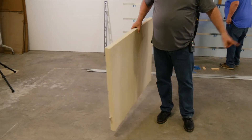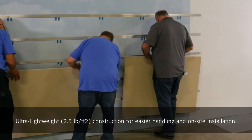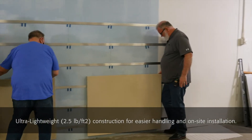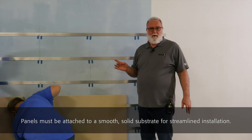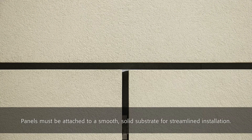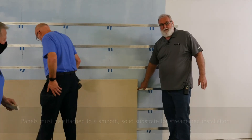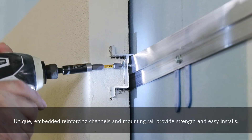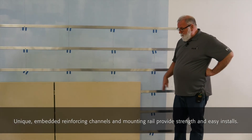This is a sand pebble fine finish, and we have a couple of other different finish types for this mockup. The panel very simply just goes up against the wall and drops down onto the fastener and slides into position. We use a spacer to create consistent joint spacing from panel to panel, which gets a wet sealant joint. And that is it. Then we just put a fastener through the top of the extrusion on the outer portion and into the rail, and that locks it in place. We typically will have fasteners on the upper right corner of a panel and the lower left corner, and that's enough to lock that panel in place.